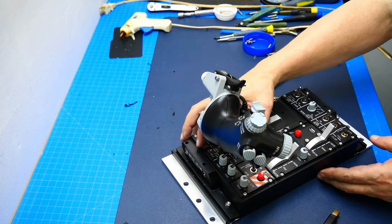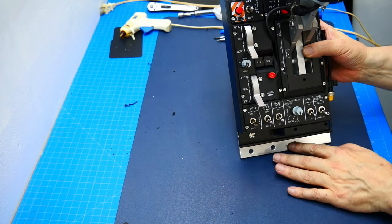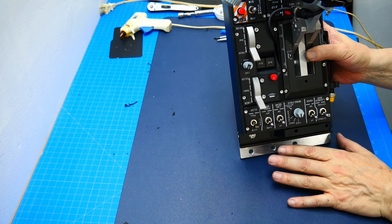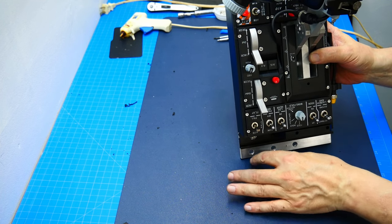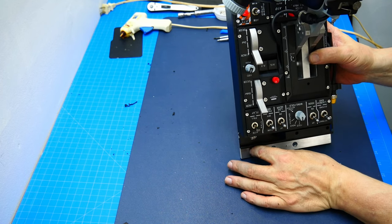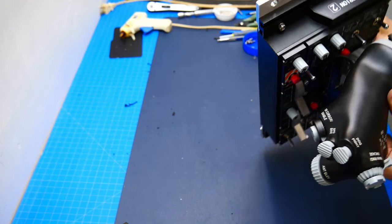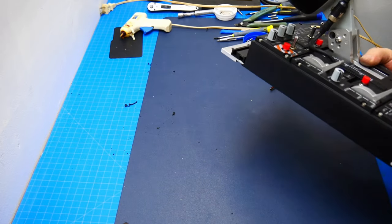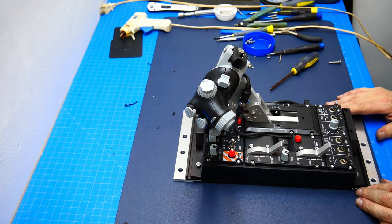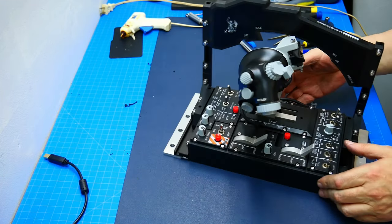I think we're good to go. We have three holes, so I'm just using a 40×80 profile, but if I should use a 40×120 I can do that. I'll also be able to move the T-slots from the outside to the center because the distance between is 40 millimeters — same for the top. So we are ready to install the detent plate. Let's put it in and see how it aligns.